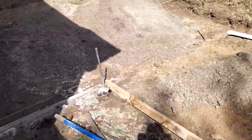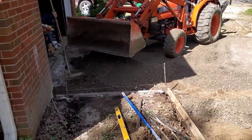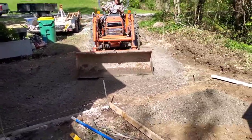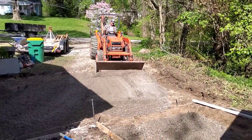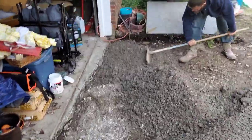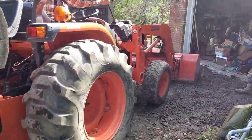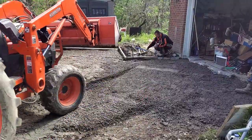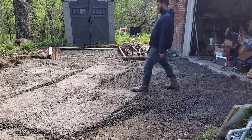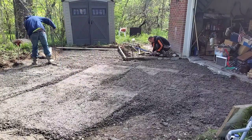This tractor works pretty good — it's a mid-sized Kubota. It wouldn't be used for farming but in Indiana we have so many different things we're doing, so it's really nice to have a piece of equipment like this. He's basically getting it close, then Josh is hitting it with the come-along. The object is to have it four — or three and a half — inches lower than our string lines and forms, so when you compact it goes down to four, because most residential concrete you're going to pour at four inches. There I am setting the form up against that sidewalk, then running it around to put that little box up for the shed.